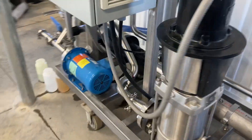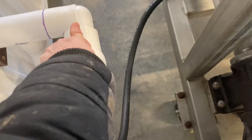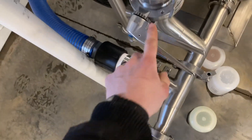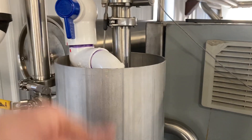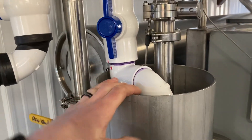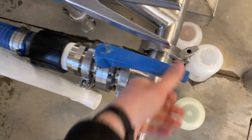Inside, the inside valves have to be set. Open this one, and make sure this one is closed, then open this one. If this one's open when you open this one and your tanks are pretty full, then it's gonna fill up with sap and start overflowing, because the level out there is higher than the level in here and it'll just start wasting all your sap. So as long as this one's closed, you can open this one and the sap's coming in.